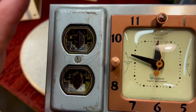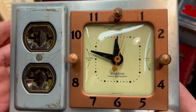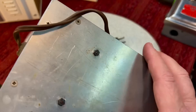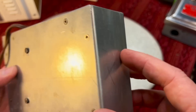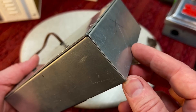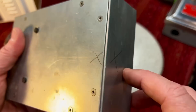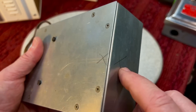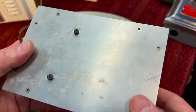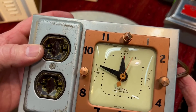So this outlet would actually not be great because you could put a 20-amp or high-demand plug in there. You can also see here some of the telltale signs — this case looks like it was nicely made by a sheet metal worker or something. He countersunk everything. Here's another telltale: you can see the X marks. Somebody marked it with a pencil so that when they put it back together, they knew which way it goes — I know that because I do that all the time. They had a little insert there to protect things. Pretty interesting.